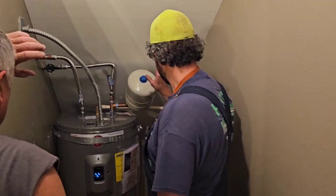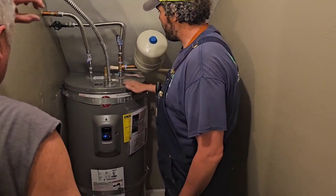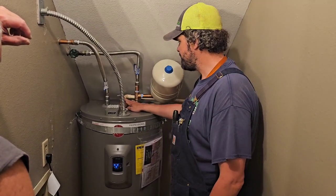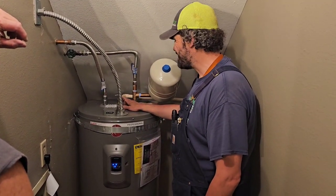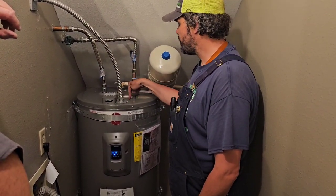So that's really important. Now, the most important thing on the hot water tank is not you getting hot water, but for you to be safe. And right at the top here, at the highest point, is your T&P temperature and pressure safety relief valve. This has springs in there that reads the pressure, and it has a probe in there that reads the temperature.